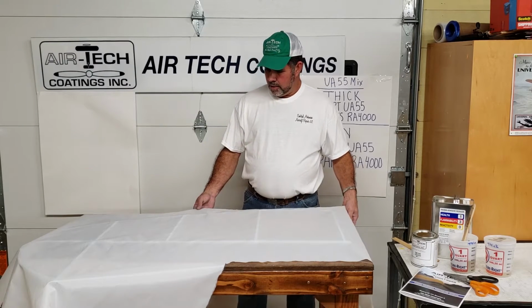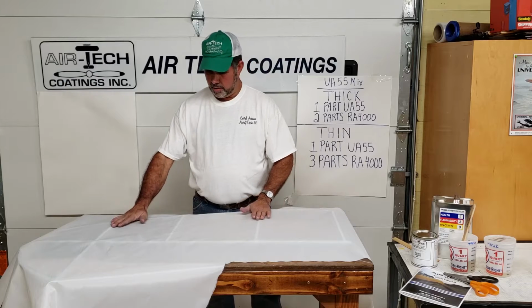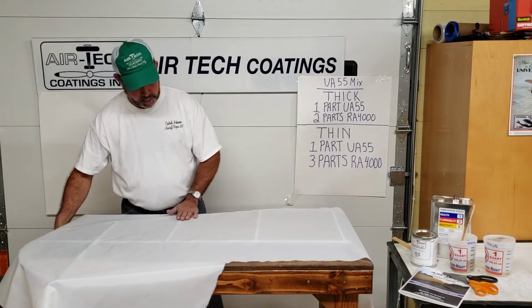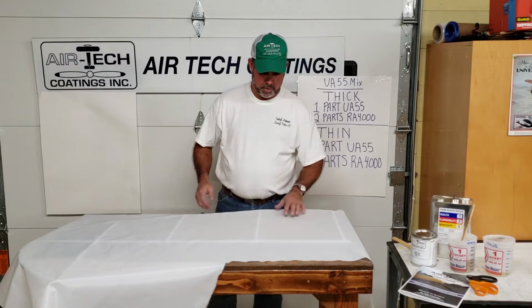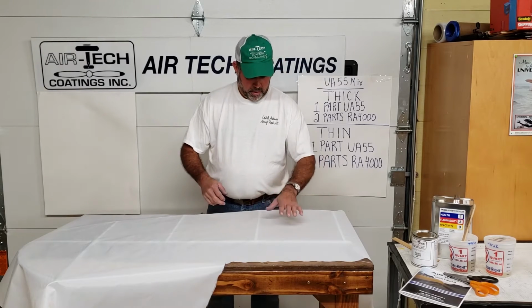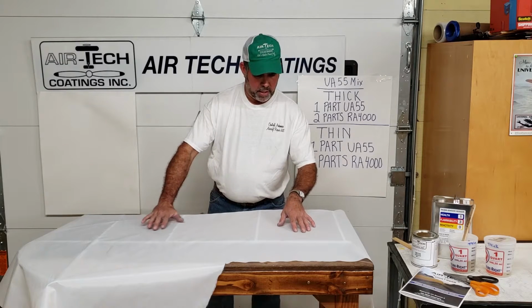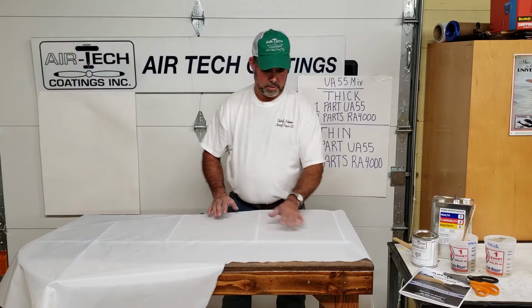But lay your parts out, you know, where your weave is running this way or this way. And I like to lay it out. It's going to shrink a good percentage. You're not needing to really get it tight. You'll learn at times you'll have a little mess up, and you'll have a little bit more slack, and if you've got a big loose area here, a lot of your shrinking may come from over here to start helping pull that out. And we'll learn that during the ironing process of shrinking it.